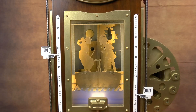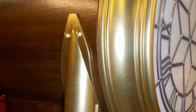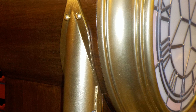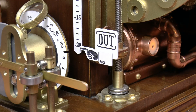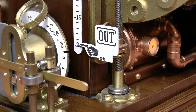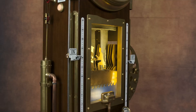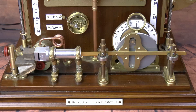Having got all this data being presented to the Arduino, it was time to work out how to actually present it to a human being. For temperature — internal and external — the idea would be to have two lead screws, one either side, that would move arms up and down. A little stepper motor at the top, with a limit switch at the bottom so that whenever you switch it on for the first time, both pointers go right down to the bottom, touch the limit switch, and then the Arduino knows where it is and can always remember how many steps to move to the position required. And it's interesting to be able to visually compare the interior and exterior temperatures.